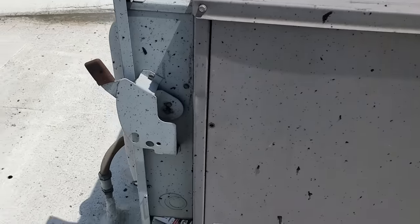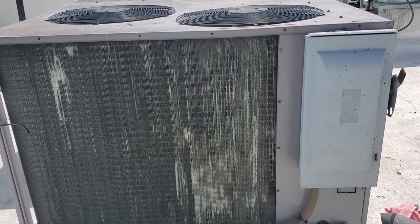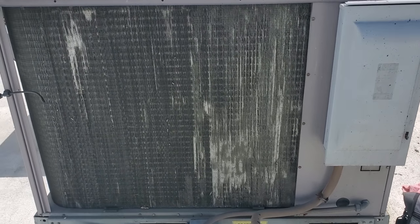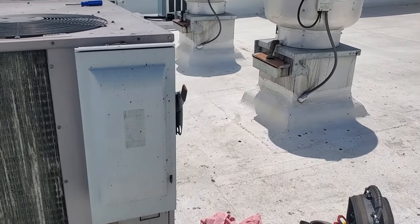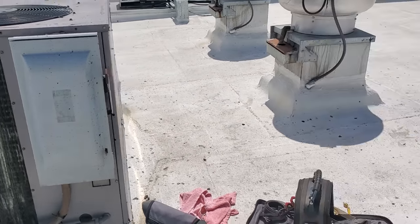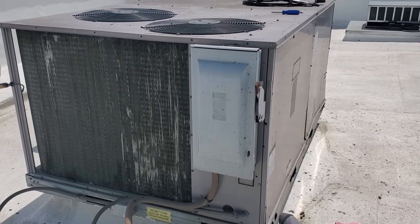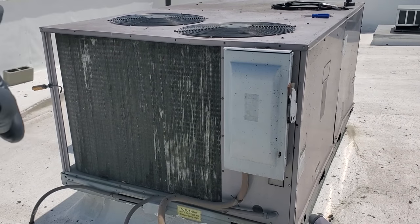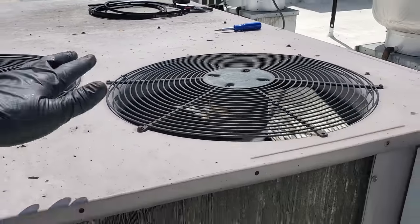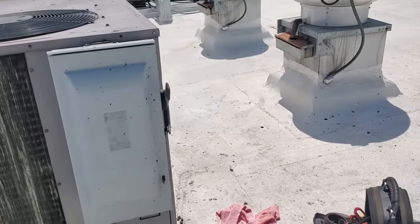I'm really questioning whether this unit is overcharged or it just has a really dirty condenser. I'm leaning towards overcharged based on what the vitals look like, but I know this condenser is dirty. So what we're going to do is schedule to come back — they're closing in about a half an hour at around 3 p.m. I'm not going to be able to look at the other ACs today. I'm going to come back, recover the charge out of the first stage, weigh it back in, pop the top on this unit, and clean the condenser by splitting it and really getting in there. But it's operating — whether or not it's going to shut off on high pressure on that first stage, we'll have to see.